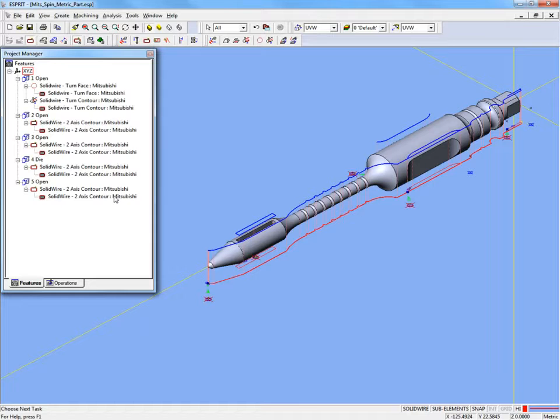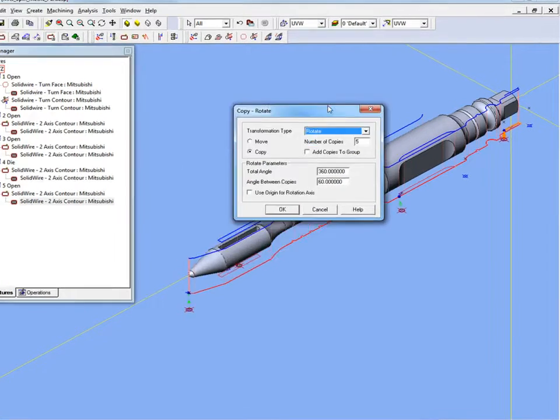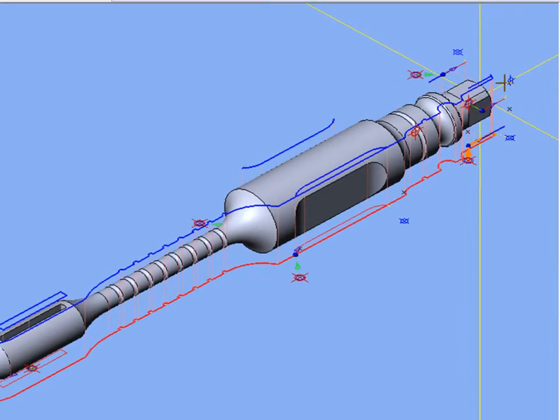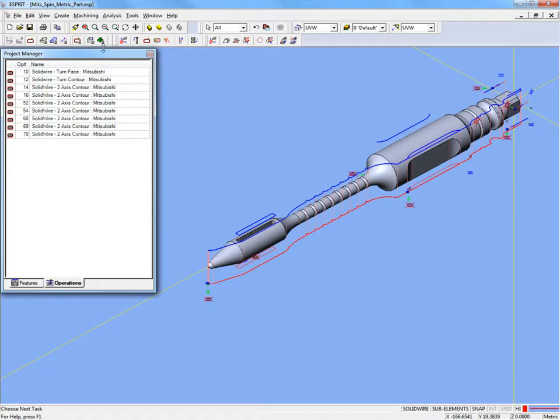With an indexing operation, the rotary axis is used for positioning between each machining cycle. Whenever a rotary move is required, the part is rotated and locked into position before cutting starts. The part is always held stationary during the cutting process. This process is simple because the operations are created like any other two-axis EDM operation, except that a positioning move is added between them.